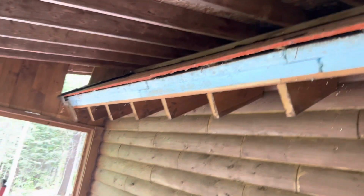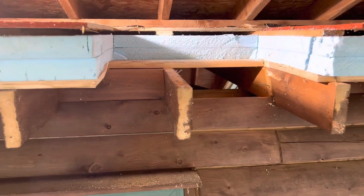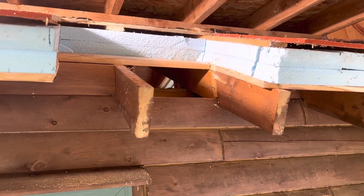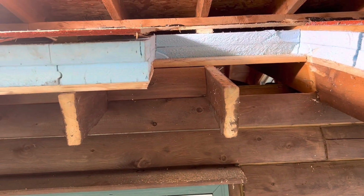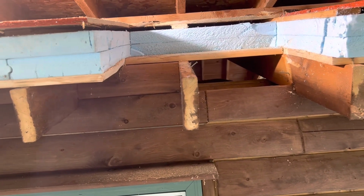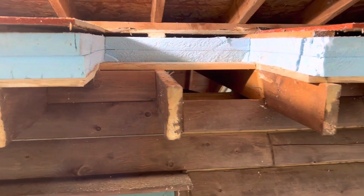That's that right there. Okay, there's the first cut back to where the new wall line's gonna go. It's about 2 feet back, and what we'll end up doing is cutting the insulation off, cutting the plywood off and the sheathing, and leaving that top row of veneer log until tomorrow, because we don't want to leave a bunch of holes tonight. So that'll be it. So we got a lot of cutting to do all the way down.